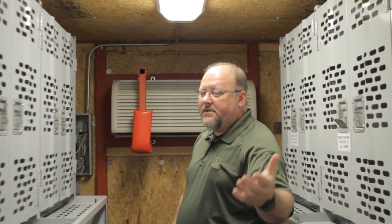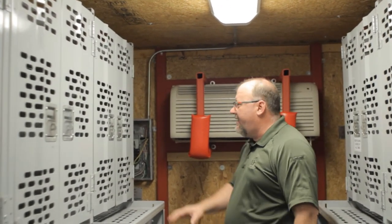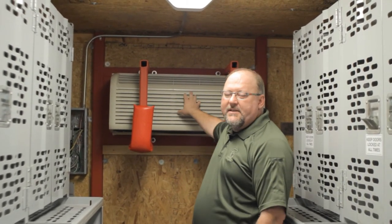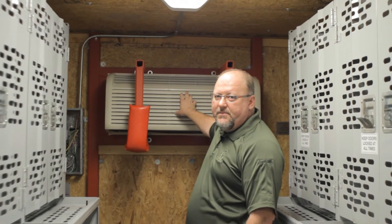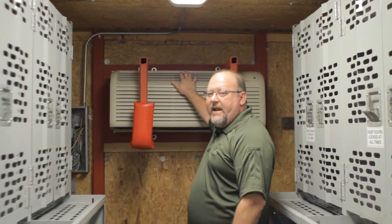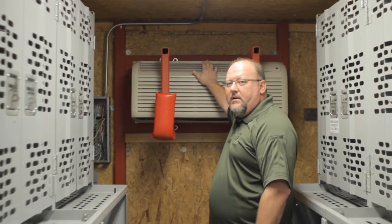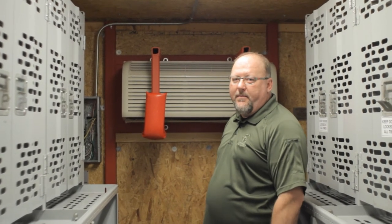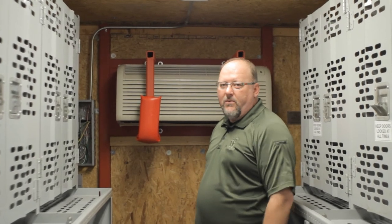As you come through the back of the tool crib, you'll find all the tool crib cabinetry until we get to the back. All tool cribs have dual P-TACs — HVACs, air conditioning systems. Standard is an 18,000 BTU unit at the rear of the module and an 11,000 BTU unit at the front, which keeps the environment cool in summer or warm in winter.